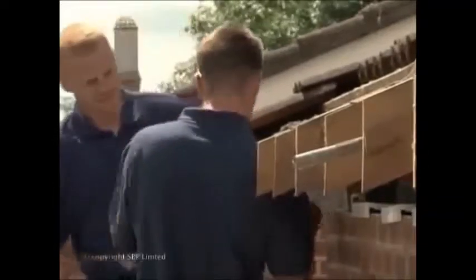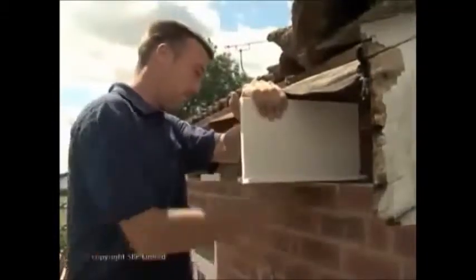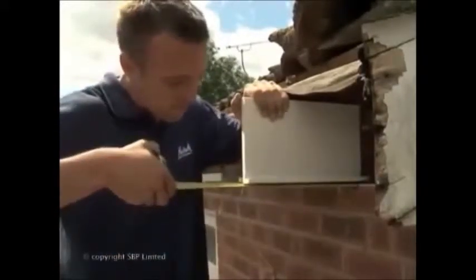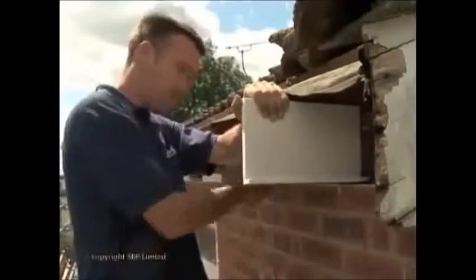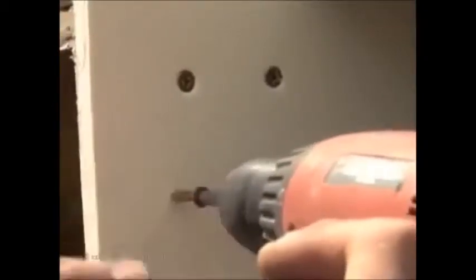Installers have a number of techniques for providing a solid and well-aligned set of fixing points for both the fascia and the soffit board. Here we can see that sections of thick cellular PVC board are being fixed to the rafter feet at either end of the run to act as hangers. These pick up the correct size and position of the chosen fascia and soffit board. Some installers use seasoned or treated timber as hangers, but whether you use plastic or timber, it is important to set up a string line to check that all hangers in the run will be in line.